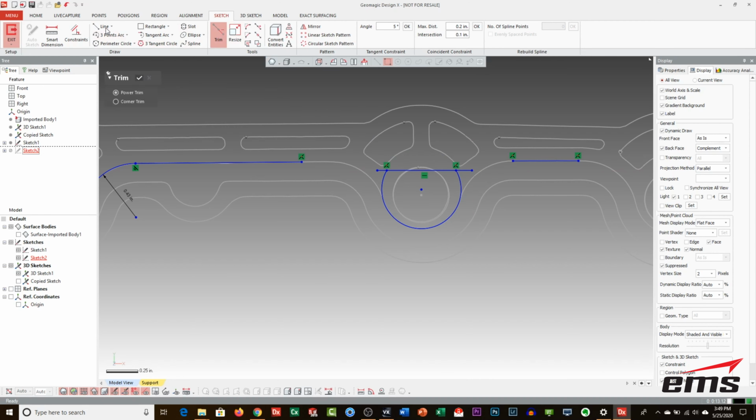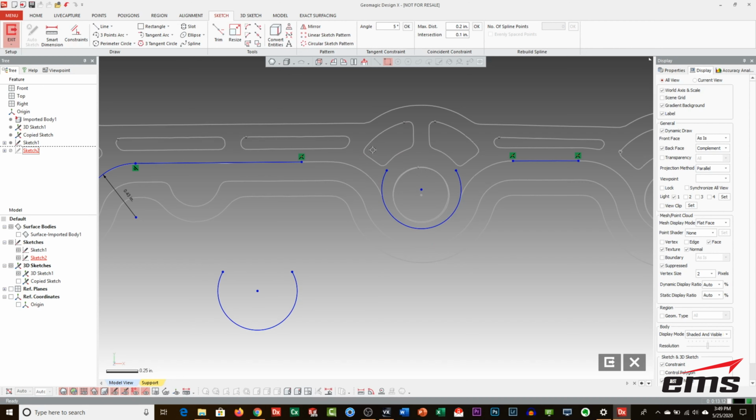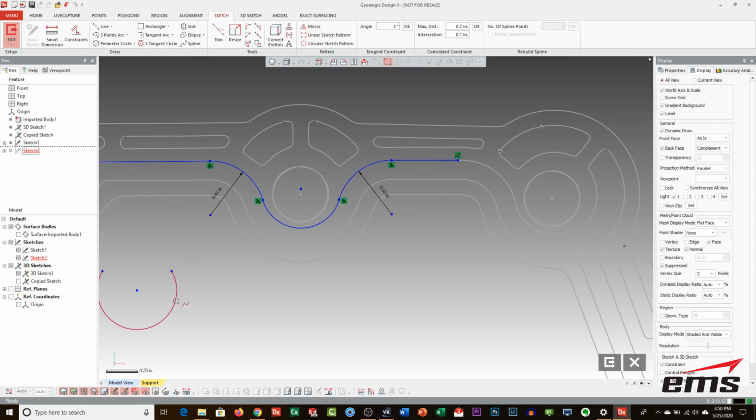Part of this is just doing it a few times and coming up with a good workflow. So let's actually copy this, and we'll paste one over here. Although when we go around a corner, I think that's going to give us trouble, but that's okay. So let's go to our fillet, and if we specify a value, we'll make this 0.43. Now when we click it each time, we should get that same value. Then what we can do is copy this and paste it over here.